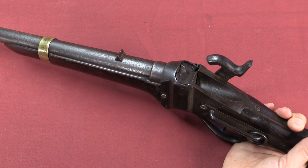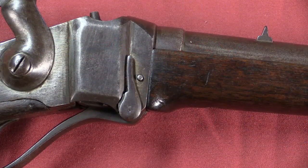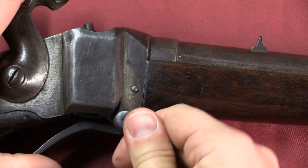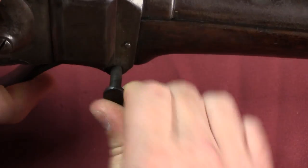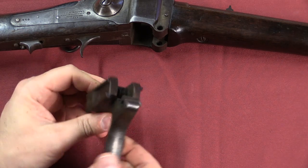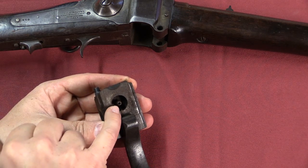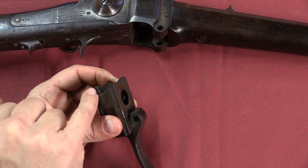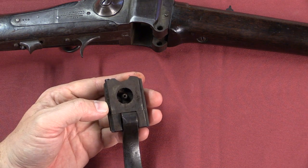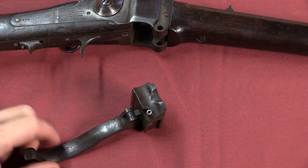In general, Robinson's Sharps carbines were really pretty good guns. Should you want to disassemble one, it's a pretty easy process — you push in this button and rotate this lever around, then remove a pin, and the breech block slides out the bottom of the gun. You have a little toggle link which is what causes it to slide up and down when you move the lever. There is the flash hole on the other end, so you have a percussion cap there and the fire comes straight through to ignite the powder charge in the barrel. These are .52 caliber, all of them.